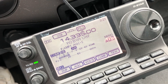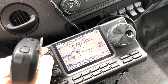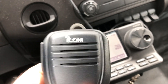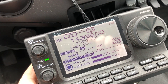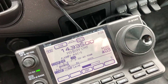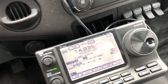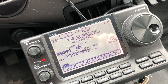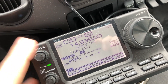Now I'm switching to the new HM219 microphone. It's physically significantly smaller, but notice there's a lot more open space for the audio to travel into the element — that really makes a difference. Mic gain is still at 60% and compression is still at mid-range. Testing K2CJB with the new mic — the compressor is showing a little more audio going into it, which means we're getting more output from the microphone. That's a good thing.